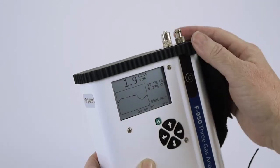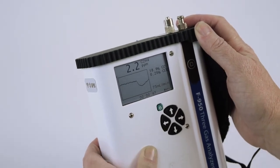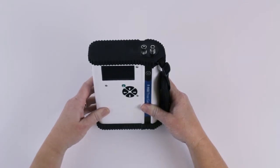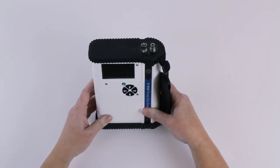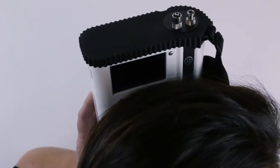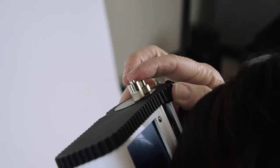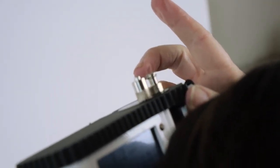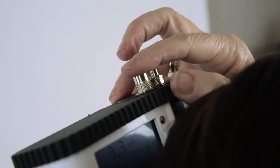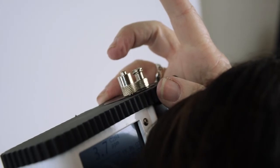If this happens correctly, you can pass on to leak test part B. For leak test part B, you're going to use the sound of the internal pump to check for leaks. Simply put the instrument next to your ear, right next to the Felix logo, and listen for the sound of the pump. You'll hear the pump running. With your finger, cover the inlet port, and you'll hear the pump clicking. When you hear the clicking sound, release your finger, and you'll hear the pump running continuously again. With your finger, cover the outlet port, and you'll hear the pump stuttering. When you hear the pump stuttering, release your finger, and the pump should return to continuous mode. If you hear those sounds correctly, you've passed leak test part B.